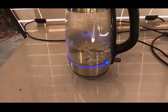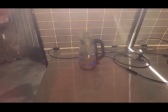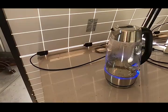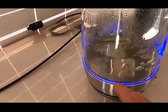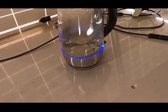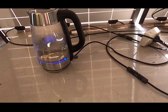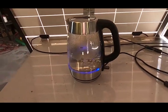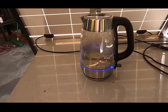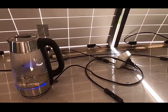No problem at all using a couple of solar panels to boil a kettle, as long as the sun is out. This will work with any resistive kettle — 240 volts here in Australia. Oddly enough the LEDs even came on at that low voltage. We've got about 78-80 volts with two panels hooked in series, because their working voltage is about 39 volts each — but still enough to light up the LEDs and boil the water quite quickly. Just a fun little project for the afternoon.